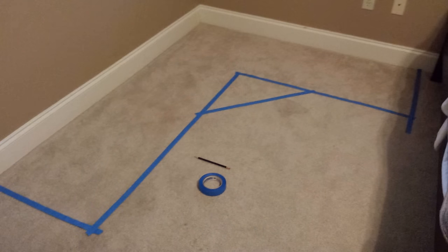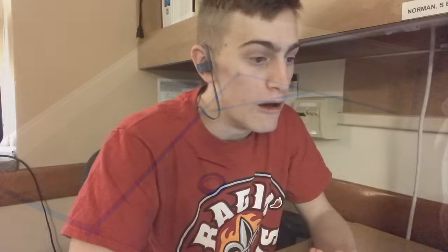Another thing you'll want to do right off the bat is get measurements. You'll need the space where you want to put the desk. I used painter's tape — that blue tape you can get real cheap, it comes up real easy — put it down on my carpet and got precise measurements using a measuring tape. Write all those measurements down: length, width, height. The height's a little difficult; I sat at a couple of desks and measured how high I'd want them. Mine was a corner desk but I didn't want just an L shape — I wanted more of a giant elbow bracket shape.